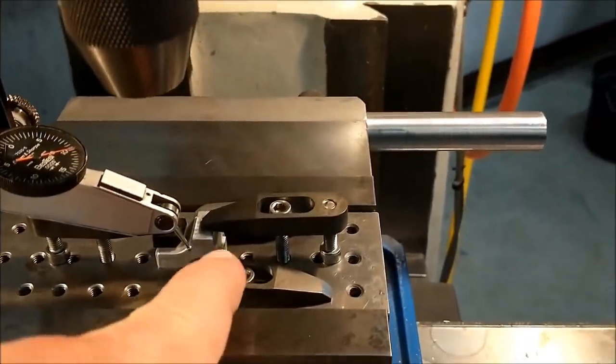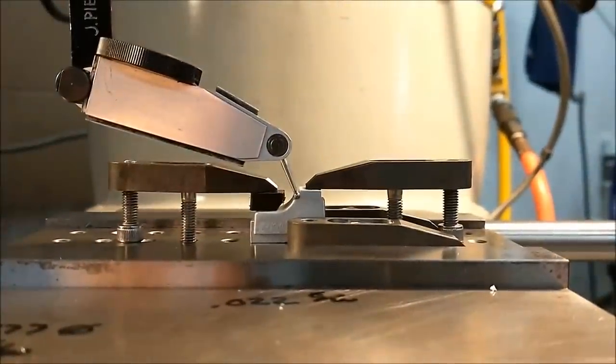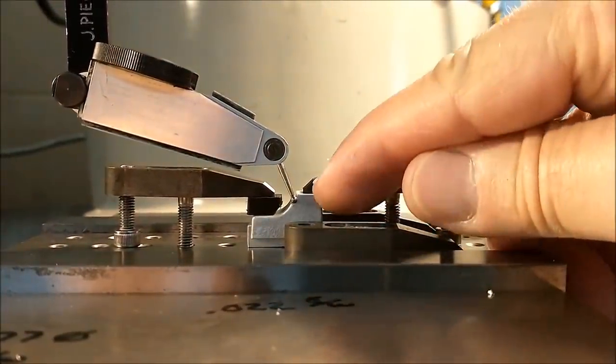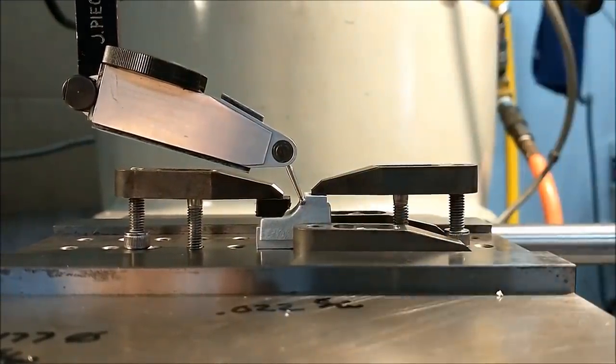Make sure whatever you put on either side will allow you the depth of the feature that you're going to put through there. So do not register everything from the top of the part. You gotta register from that step right there. Then it goes further down.